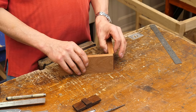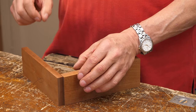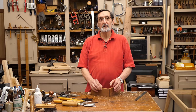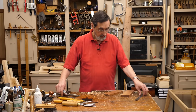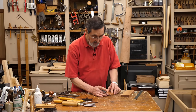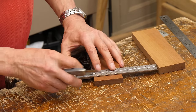I've got a 20 millimeter front piece and a 15 millimeter side piece. My rule of thumb is to have the length of the dovetails be three quarters of the thickness of the front piece. So in this case with a 15mm side piece and a 20mm front piece, the length of my dovetails will be 15 millimeters. First I'm going to take my knife and make a measurement — 15mm from the very front edge of the drawer. I've made sure the drawer side is absolutely dead square.